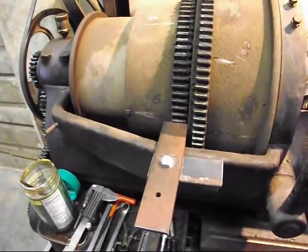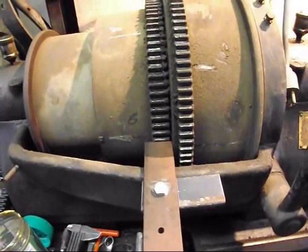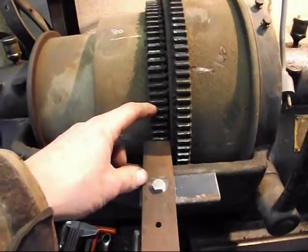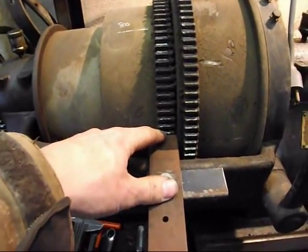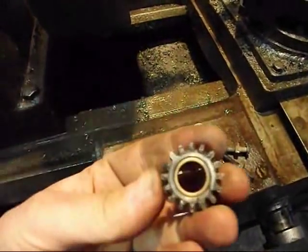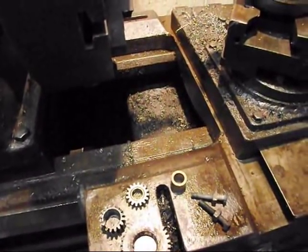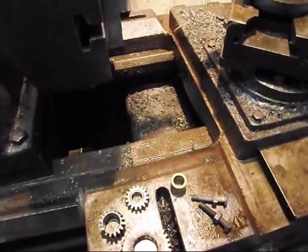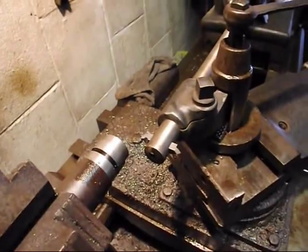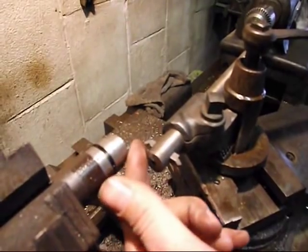Well, I might have gotten lucky. I was trying to figure out how to stop the spindle. I had a designated spot. I said there's no way this ring gear will work, but it's got 96 teeth. Here's how I can count — the little gear is 16, so that figures out correctly. I got my profile ground in there in the cutter tool bit.